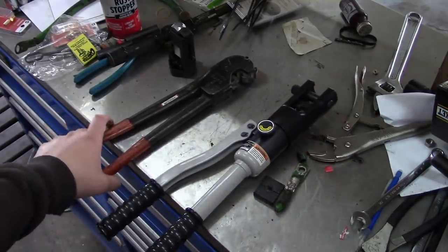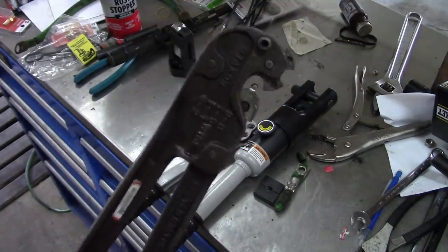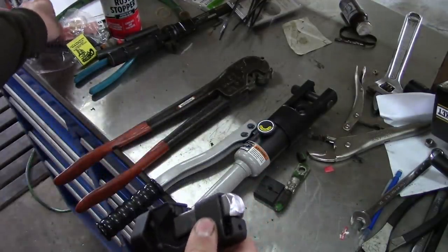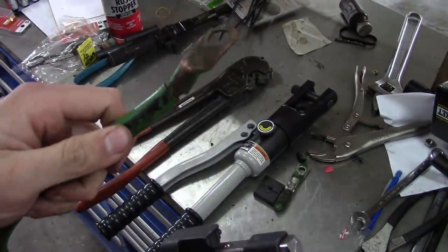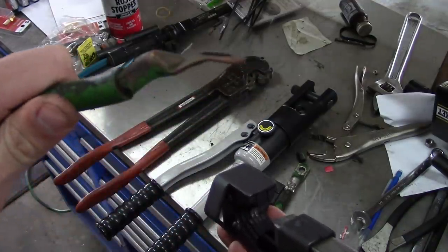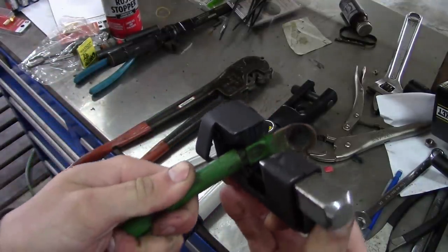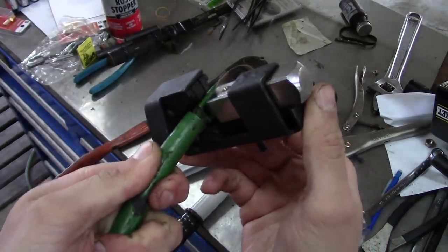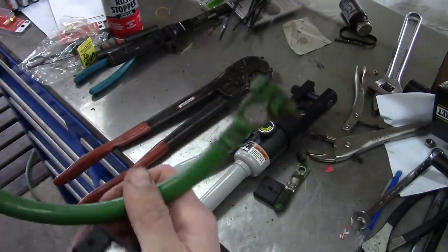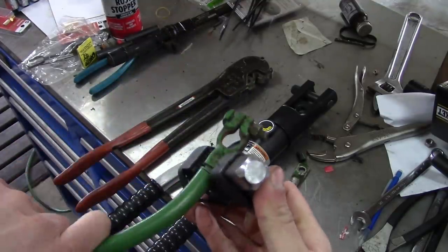And I've got other crimping tools. So the stake-on crimping tool here is a little easier to use. It's certainly faster and more convenient, but crazy expensive. So I have this thing too, which is like a hammer style crimping tool, and you can see this battery cable was on the tractor and it was crimped, I'm sure, with a tool just like this. So it works, but it makes this kind of weird triangular shape crimp. It has to, just by the way the tool is built. So you see right there, I'm certain that that's how that lug was crimped. Same with this end.